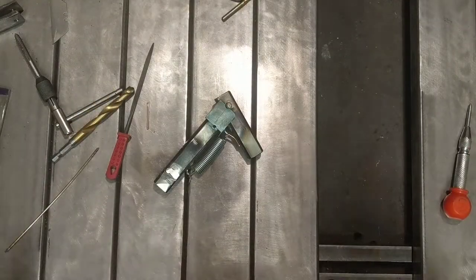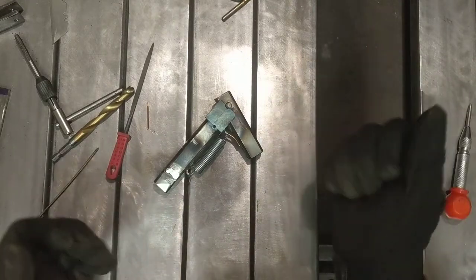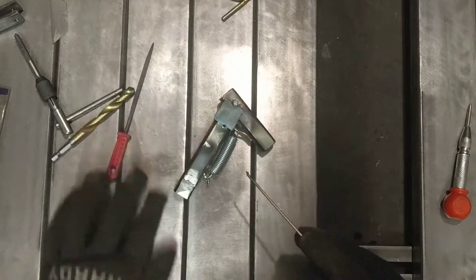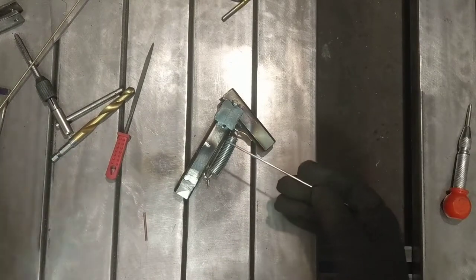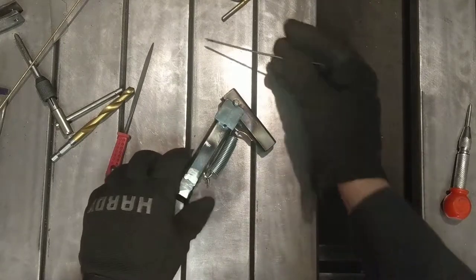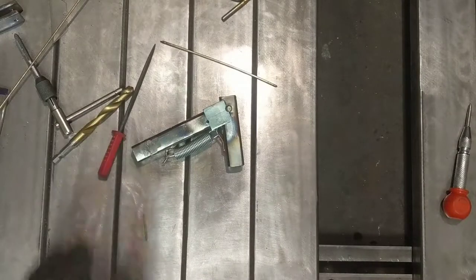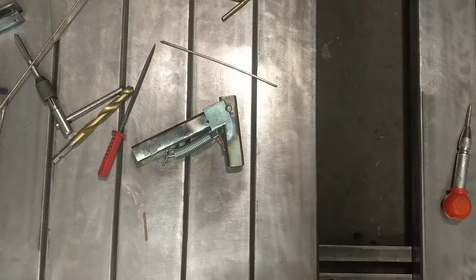Had a bit of a brainwave there. Decided rather than try and shove the melting ER70 into melting steel and have that somehow work out while the arc was still going on and everything like that, that I would use silicon bronze to build up a bead right there and then shove the ER70 into it. A little bit of changing hands and trying to do that in the dark and arc light and all that, but seems to have worked out. And I wrestled with the TIG wire enough to finally work out a good spring preload there that looks pretty good. I'm happy with this. Ready to move on to the main event. Bending our half-inch stock, wherever it went.